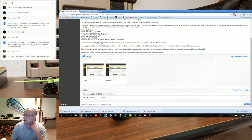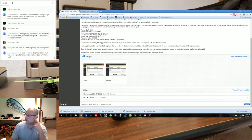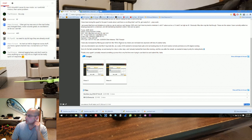So Adam, that fixed the issue with the yaw stability. Were we talking about the yaw stability? I can't keep everybody straight. It was the getting destabilized on yaw, Adam. That was you, right? And the new set of ESCs fixed it. If that's true, then that's awesome. But I still can't figure out why we didn't see a big twitch in the PID sum. Maybe it was the expo shrinking it down, but it was pretty huge. So, anyway.